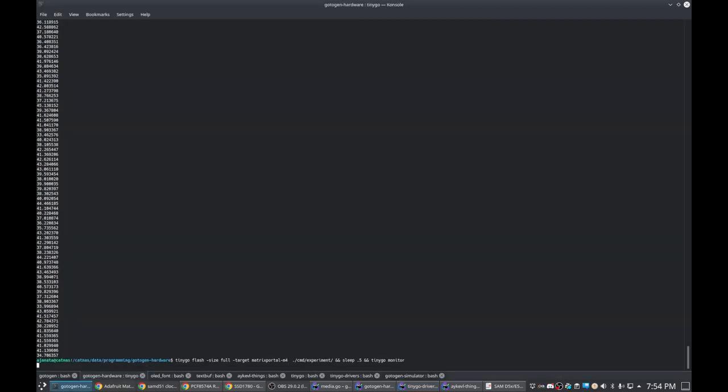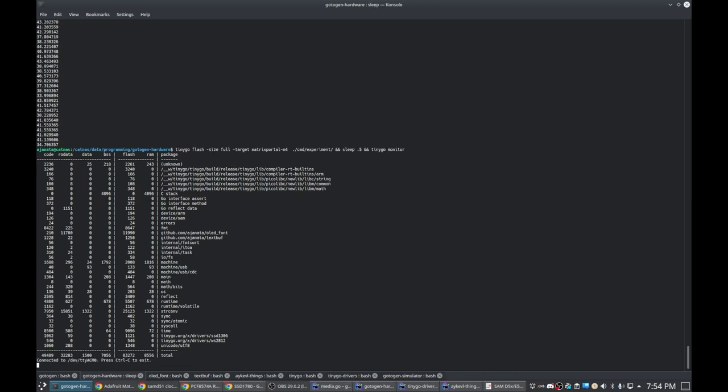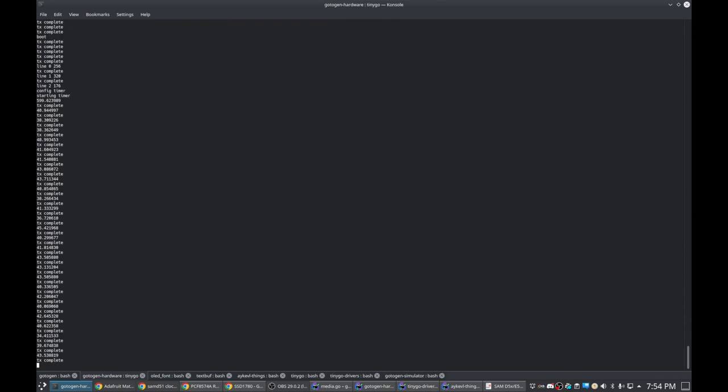So I'm just gonna have it print every time there's an interrupt, which is not good. It's going to be slow, but that will let us know if at least the DMA controller is finishing its job. And the DMA controller is, as far as it is aware, doing a DMA transfer every single time. So at least we are configuring DMA and it is happening.